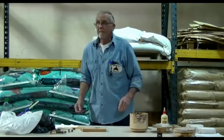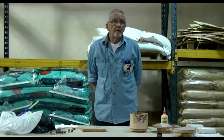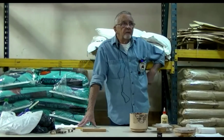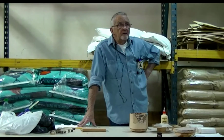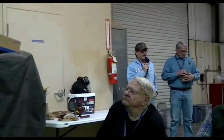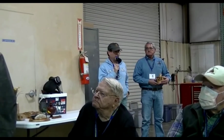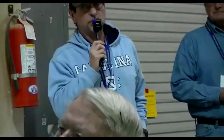Gene, I think we have an expert in the room who could tell you about the temperature that resin's going to get to. Jay, do you have a number, since you've worked with resins a lot? Yeah, so resin's curing process is exothermic, meaning it gives off heat. The larger the quantity of resin, the greater the heat. So if you're pouring like a gallon, it's going to get pretty hot, to the point of 140, 150 degrees. If you're doing small quantities, it won't get as hot. But to Gene's point, looking at what he's doing, there's probably a couple ounces, which means it's going to get up to about 120 degrees or so, plus or minus.